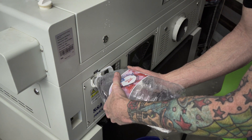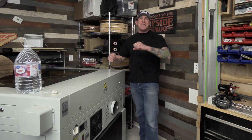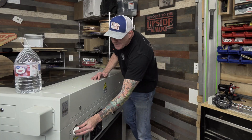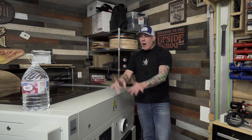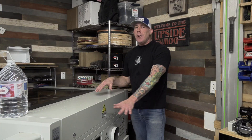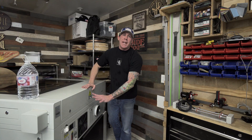We're going to remove our hose and put the fill cap back on the water outlet. This does not take a lot of water — off the top of my head, about one and a half gallons. While you're filling it up, pay attention to that level gauge on the right hand side where the red, green and yellow sticker is. I did unplug the power cord from the machine prior to draining the water. This chiller works in a closed loop operating system — that water needs to feed into that glass tube, circulate through, and come back into that chiller. Once we power cycle this unit, that water is going to start flowing into that laser tube, which will lower the level of our distilled water, so we'll want to do a visual inspection to make sure we're still within the normal operating range.